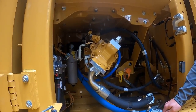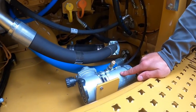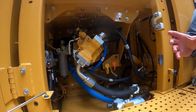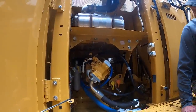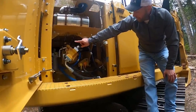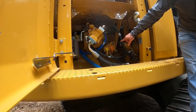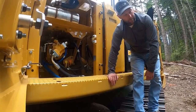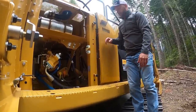They were talking about falling next week, but with this rain, I'll try to push it. Everything's pretty close to ground level stuff. Obviously, high and wide, it's a little more difficult. Anything you see with a colored port, it's either a test port or a quick drain. Anything that's black, that's a pressure port. So if we have to come out and test something for pressure, that's what you're going to have there.